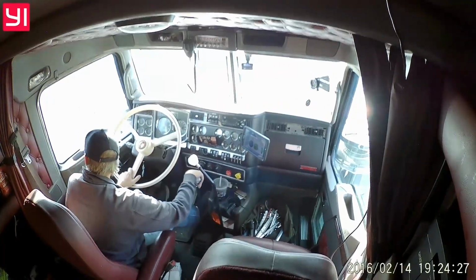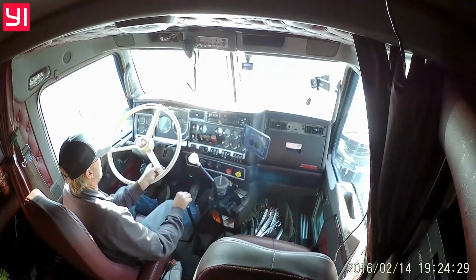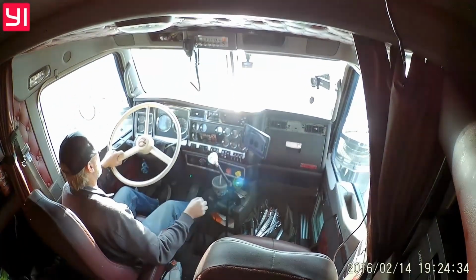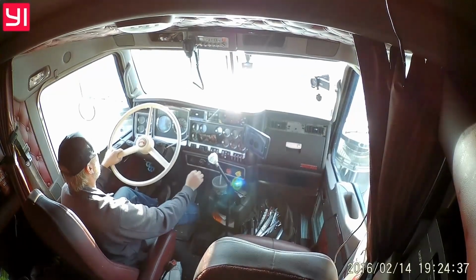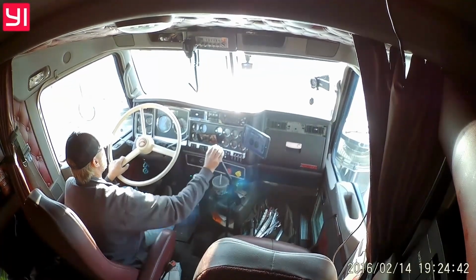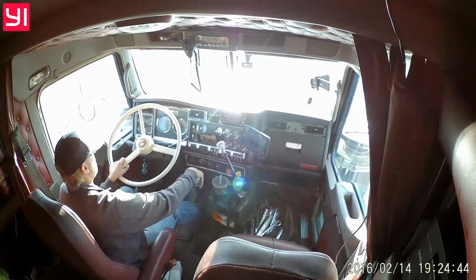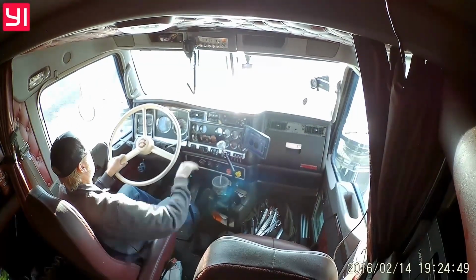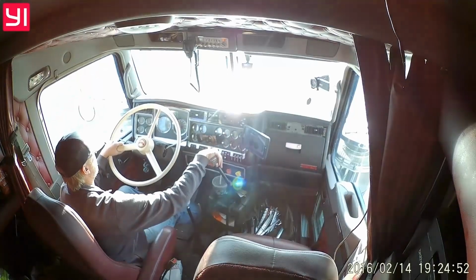So if you've got an old 13 speed that does not like to pre-select, it would shift about like this. Get through the gears in the bottom half. Go over to the top. Shift up here. You shift your top one. Shift up here and then pull that down.